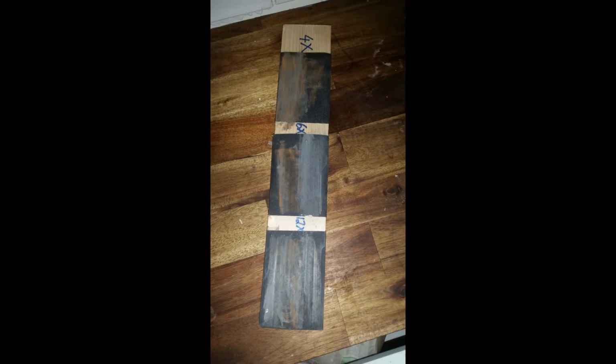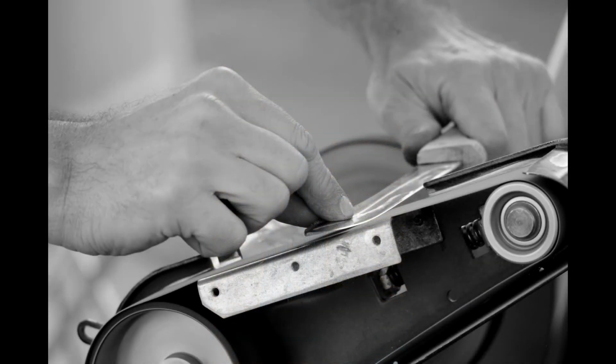Place this over a hard surface. You want a hard surface, as what you're going to be doing is controlling most of the work with your hand. Having a hard, level surface is going to make this much easier. Unlike a razor blade, in which you would use a strop, and that the movement of the razor over the strop isn't a concern, you need to think about this more like a kitchen knife, where you do not want the edge of the blade to be rounded over or become warped by being worked. This is why you go with a hard surface.